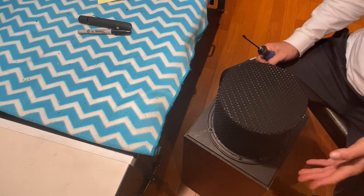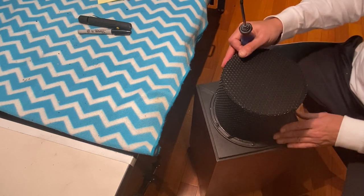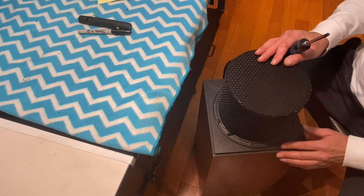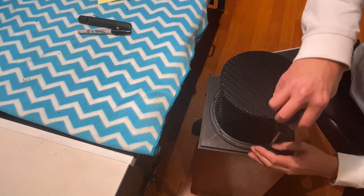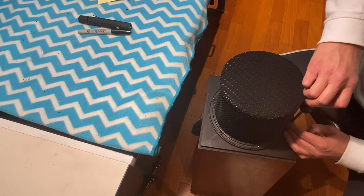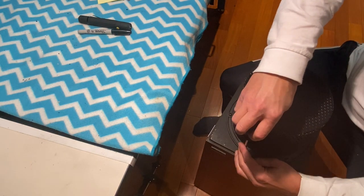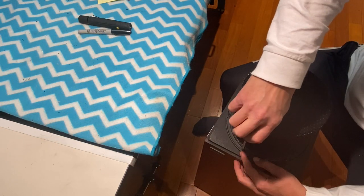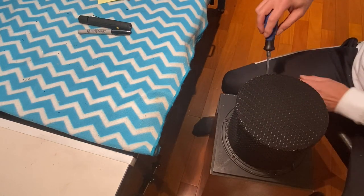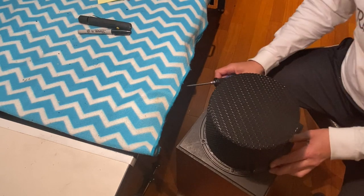Okay, yeah, seems to be a good fit. Again, as I said, with the binding posts, with the screws, don't over-tighten these screws, especially for me at this point, since this has to come out, I still have to do the foam. This isn't the actual module we're gonna use. Again, protect these threaded holes that we've now made and work with them very gingerly. Okay, I'm just going to tighten them enough to make sure that everything is sitting flush and I'm not going to over tighten them, especially at this point. Okay. That's good. Yeah. Seems to be flush.